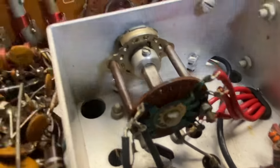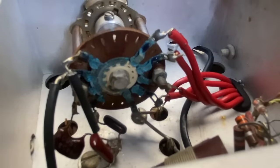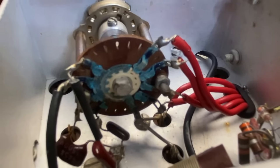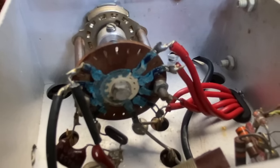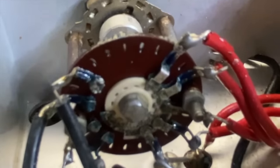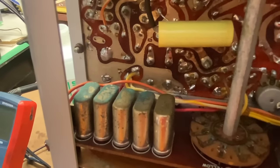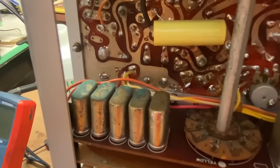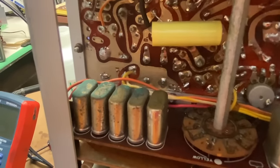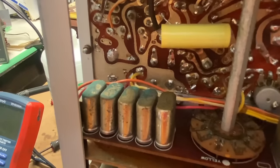I've got two wafer switches with quite a bit of corrosion and tarnish. So I'm going to get that toothbrush out again, get the Brasso after it, very lightly — it doesn't take a whole lot. Quite a bit better. Still a little bit of blue in the rivets, but I think the contacts are clean now. You can get manic trying to make these things pristine. What I want to do really is just stop the tarnish where I can, and once this rig is in a controlled environment, it's not going to come back.